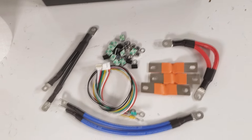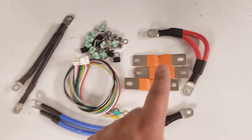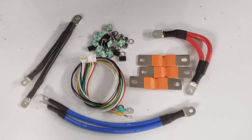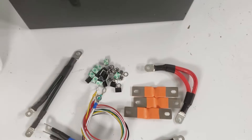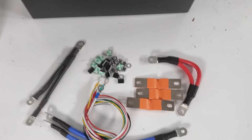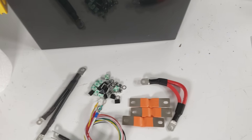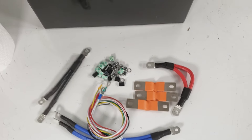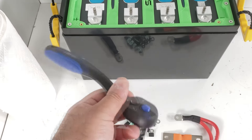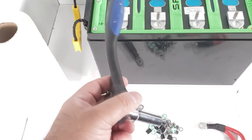From the accessories and cable zip-lock bag you've got: blue wire, red wire, flexible bus bars, black wire, a combination harness, nylon insert steel lock nuts, and wire guide clips. Get your paper towel and isopropyl alcohol and clean all the terminals completely — spick and span. We explained this in the manual, but we'll show you how we've set it up. Use a hand tool — we do not recommend an impact driver.